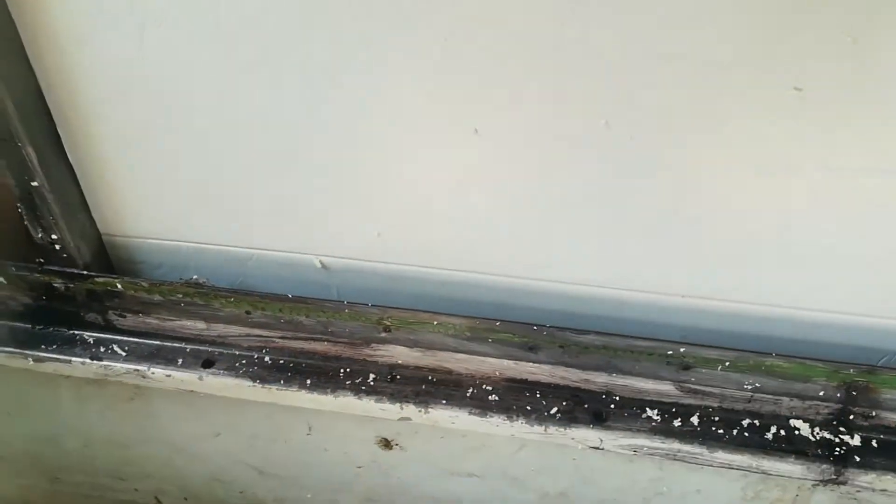The nice thing is you've got all these screws sticking through, so you can put the first sheet in and push it right into the screws. For the second sheet — these are four-by-eight sheets — if you cut it at 27 and a half inches for the width of the sections, you end up with a 32-inch piece for the depth. That leaves a 16-inch piece, and 16 plus 16 makes 32, so every time you cut a 27.5-inch piece you also get a useful 16-inch leftover piece.